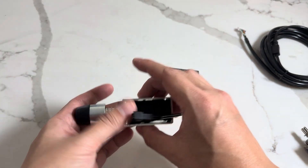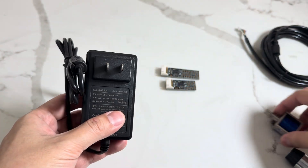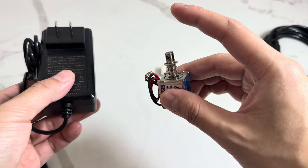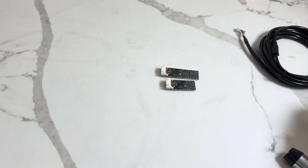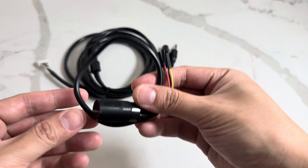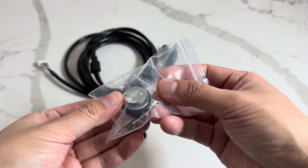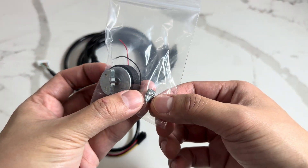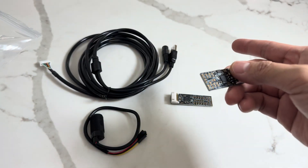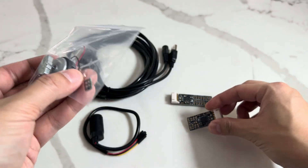When you purchase a solenoid, make sure you purchase a corresponding power adapter that matches. If you're using a 12V solenoid, use a 12V power adapter. If you don't, you'll either not have enough power to activate the solenoid or you'll have too much and end up burning it out by double-voltaging it. What we will include is the cable, one PCB of whichever one you choose, and the official IR camera from DF Robot — so you don't have to pay for shipping separately. We'll also include a rumble motor — the recommended one we use — and a little extender PCB, because the rumble motor wires are quite short and most people will want to place it in another location.